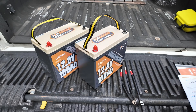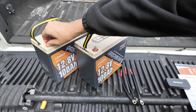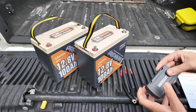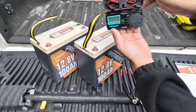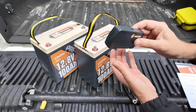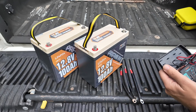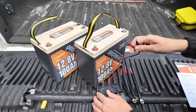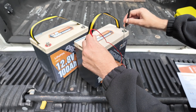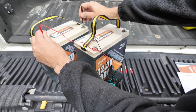Here are my two Power Queen batteries with their little protective caps on — let's get rid of them. Let's take out our portable pocket meter, this is the Allosun. I did a video on this a long time ago and I still love it because it folds up nice and flat and won't stab you in your leg through your pocket. Set this to DC volts in the 20 volt range, connect positive and negative, and I read 13.09 on that battery and 13.29 on that battery.